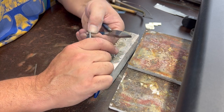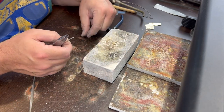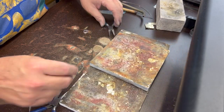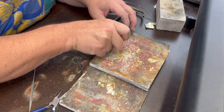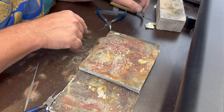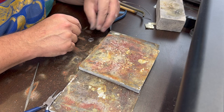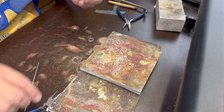I've definitely learned quite a bit about putting these together. I think it might be helpful if we soldered these bottoms together first. I was going to just do it all in one, but if I do that, then there will already be some solder in place, and then I can just push them in right next to it, and I might add a little bit just to be safe, but there will definitely be enough to get it stuck down. So let's do that. Get those nice and connected.